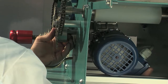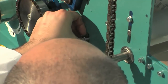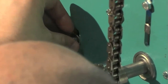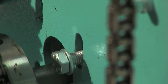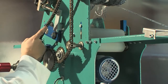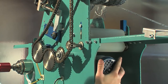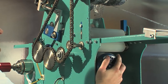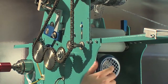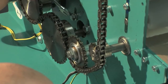Connect the gear to the gear motor output shaft. While still supporting the gear motor, insert the fastening screws without blocking them. Adjust the chain tension by manually moving the group along the vertical axis until the right tension is obtained — about 3 cm movement halfway along the upper part. Now tighten the screws.